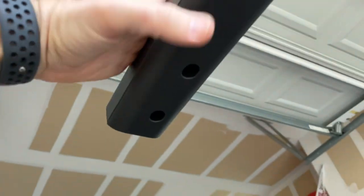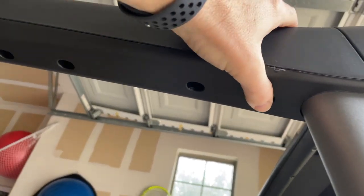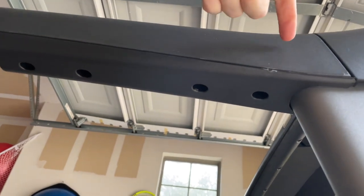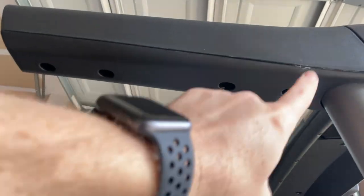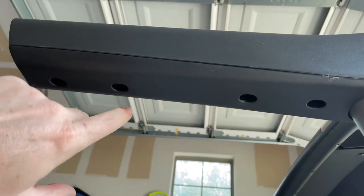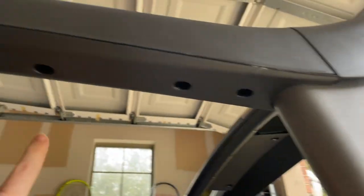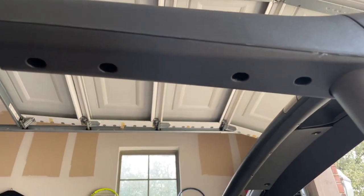An important detail on the four holes for the arm covers: the two outside holes go into plastic posts coming through the top piece, so keep your drill on a low clutch setting. The two middle holes go into the pre-threaded metal arm, so turn the clutch up a bit more to drive those screws in. If the outside screws go in more easily, that's expected — plastic versus metal.